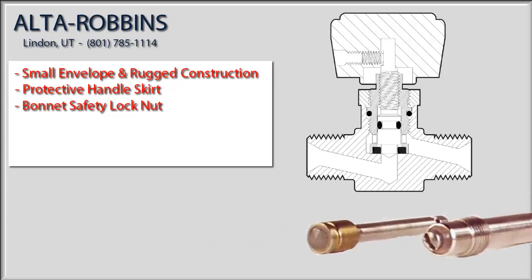Really, the difference is in the seat. Our typical competitor seat is relatively small in size and is installed directly to the tip of the stem. It moves up and down with the stem and is completely uncontained. Every time the uncontained soft seat is forced into the edges of the through hole, it loses its shape. And of course, to ensure that it doesn't leak, the operator continues to tighten and tighten it until it actually cuts all the way through the seat and results in a metal-to-metal shutoff or a failure.